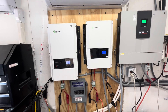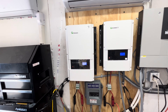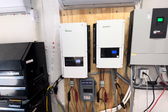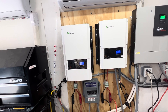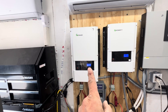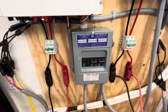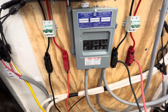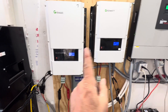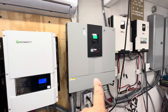Those are running the air conditioners, and we're now also running our pool heater — a 12 to 12.7-ton pool heater that was pulling around 160 amps on each 120-volt leg. It's dropped down to about 42 to 59 amps, and now we can start it up and run it with the 12-kilowatt inverter. We also put in grid assist where our grid power comes in, and we distribute 240 volts to three breakers — one each for the 12-kilowatt, 6-kilowatt, and 5-kilowatt MPP inverters.